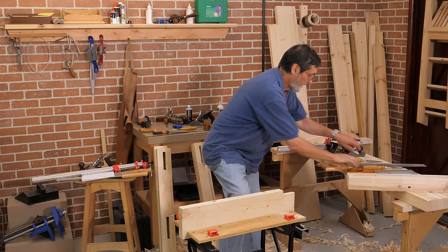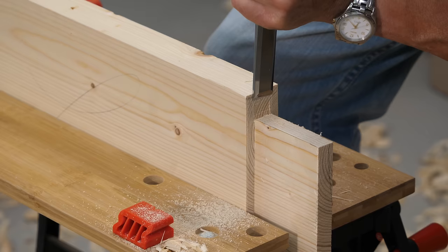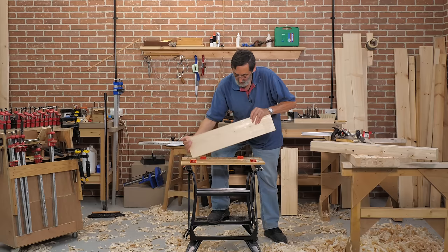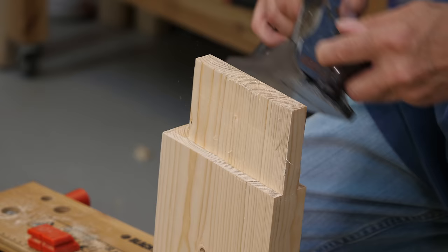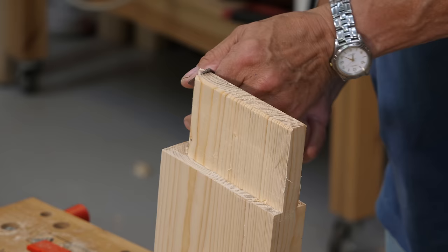And I'm going to take a chisel down here to pare cut the surface fibers flush, like that. May as well, while I've got it here, put this in here. I am going to put a slight bevel around the edge just to ease this into the mortise hole here. The same on this edge here, the corner. Just eases it into the hole.